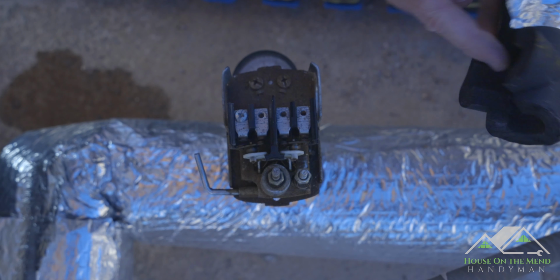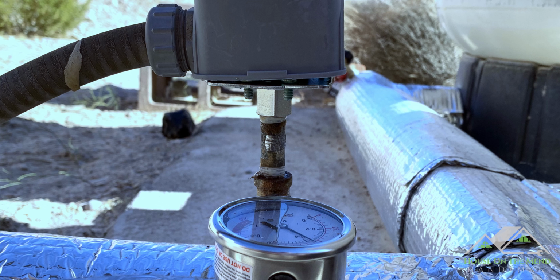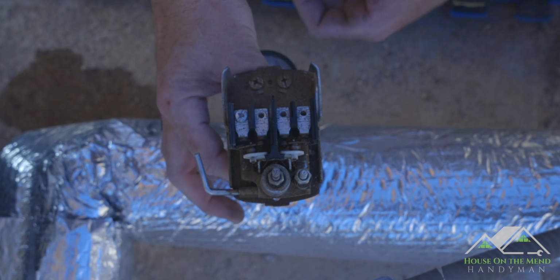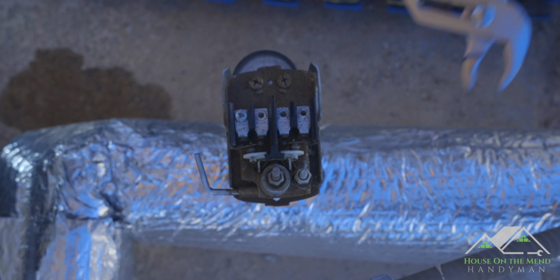It's a nice little 90 degree corner piece that I put in there. Right underneath this box there is a stem, and then there's also a nut. So that's where we disconnect this pressure switch from. So we're gonna protect that stem with a pair of channel lock pliers. At the same time, we unscrew this top piece.